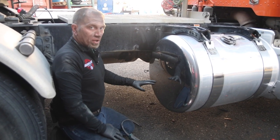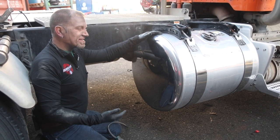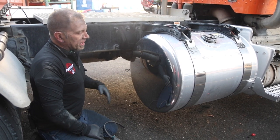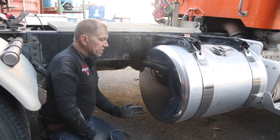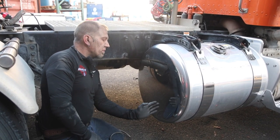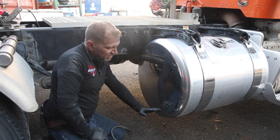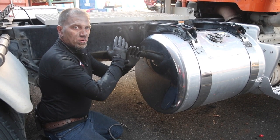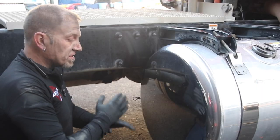Now our end cap is cut and ready for color — we did three passes on this one. This end cap was a little damaged and spent its life getting acid-washed, so we wanted to get a really deep cut. Remember: you do a diagonal cut, then a 45-degree left angle cut to cancel out the diagonal cut marks, bringing a different cut mark all the way up the tank. I went ahead and did a third cut at about a 45-degree right angle to cancel those other cut marks, creating a crosshatch pattern.